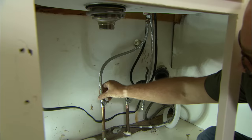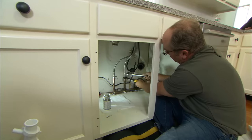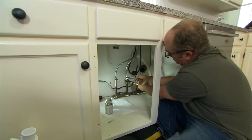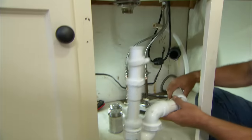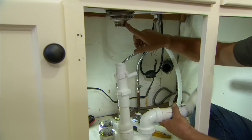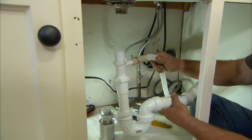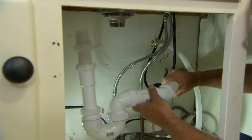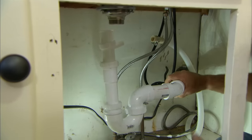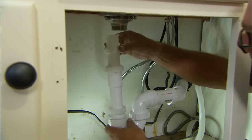Working from the back, we'll make our water connections — they're labeled hot and cold on the faucet. We've got flexible supplies; tighten them up with a wrench that won't scratch them. Our last connection is the drain — from the single basket strainer we'll adapt this branch tailpiece, which has a branch on it for the dishwasher discharge. Then we put in our single PVC trap, which has a glued section and a mechanical connection. We're on the home stretch.